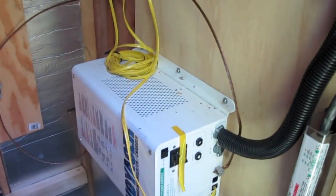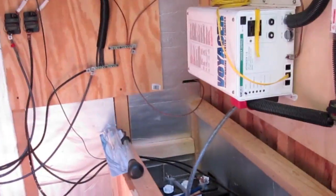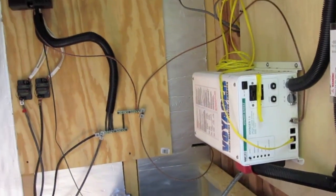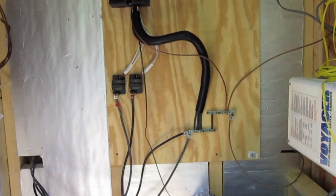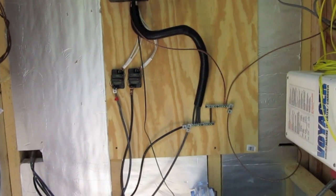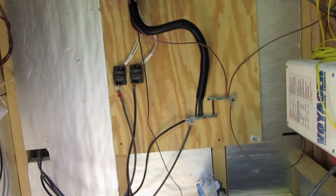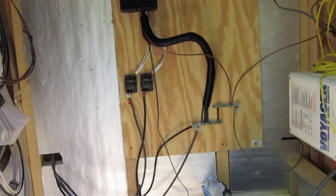I do have a plan for it on the website. Back when I put it together it probably cost me $2,000 total. If I had to do it again the same exact size, I probably wouldn't buy the really expensive charge controller. It's an MPPT charge controller because I have high voltage coming in and 12 volts coming out. I could go with a company like Morningstar — they have one that would fit my needs for around $100, whereas this one was $500. So I could reduce costs there.